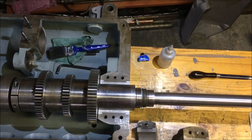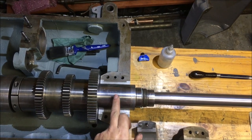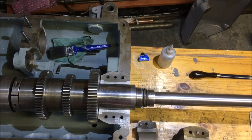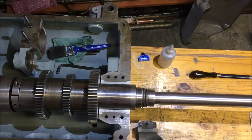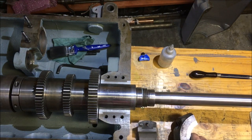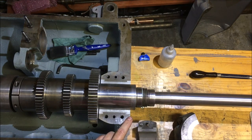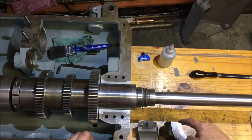All right, so the next job, having established that the gear meshing's all right, is to basically reduce the gap between the top of the journal and the underside of the bearing cap. Now, we've had it on and checked the rise, and we've got 8 thou. That needs to be somewhere in the region of 1.5 thou after we've scraped it. So we know that we've got, let's call it 7 thou to come off there. You see that? Come off on the underside of those faces.